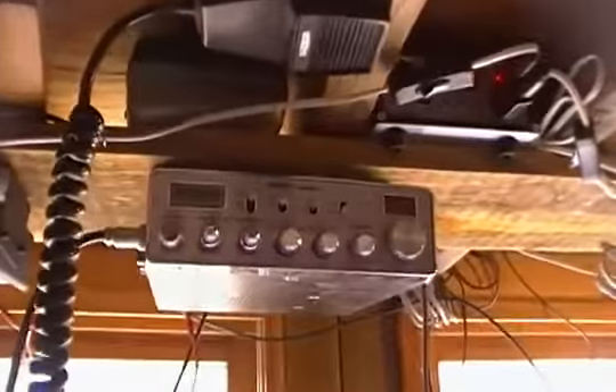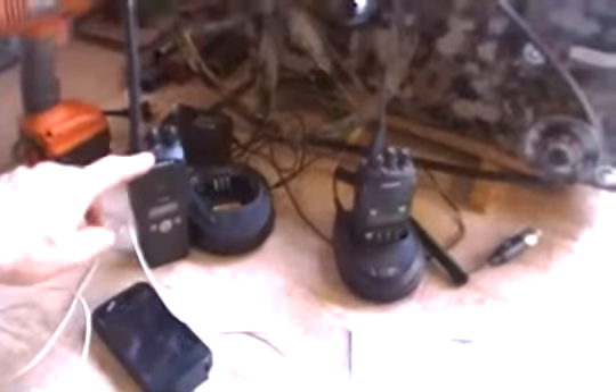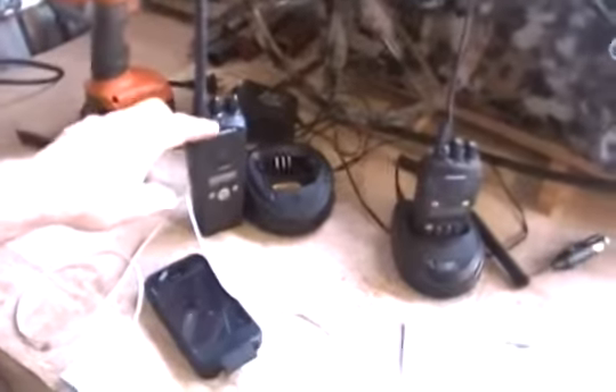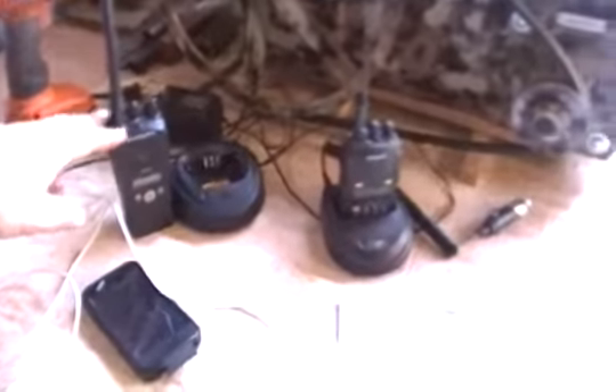Now this system is small — it's 45 watts and it will not do a lot. I have two sets here so I have 90 watts total. I use it to run my communications gear: CB radio, ham radio, a couple more CBs, and to charge all my handheld radios. That's my fireman radio — in a really bad situation I want to keep that running. If the battery ran out and I couldn't charge it, I wouldn't be any help to my community. I also use it to charge my cell phone and laptop. So basically my 90 watt system keeps comms gear running and a few lights going. I can also run a fan off it with an inverter.